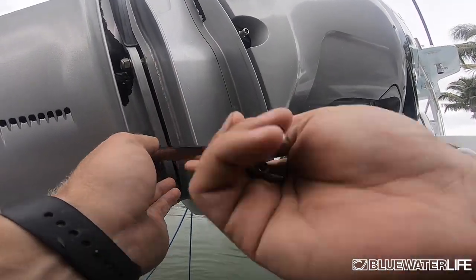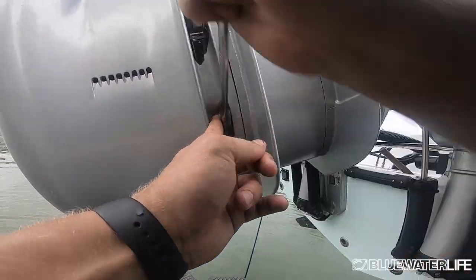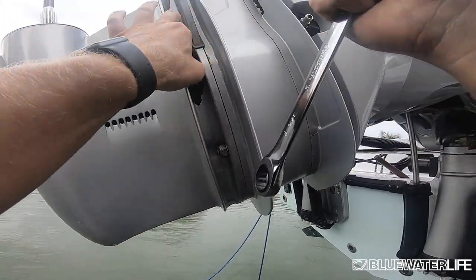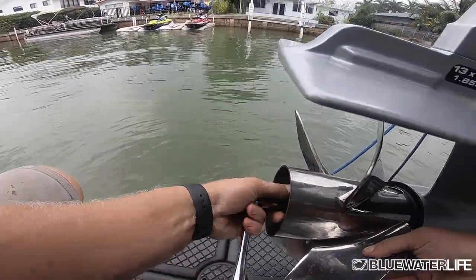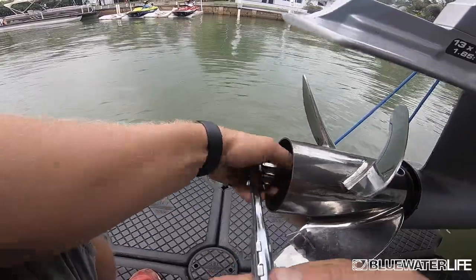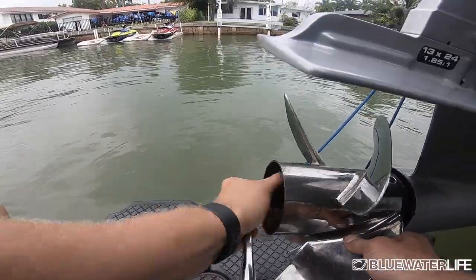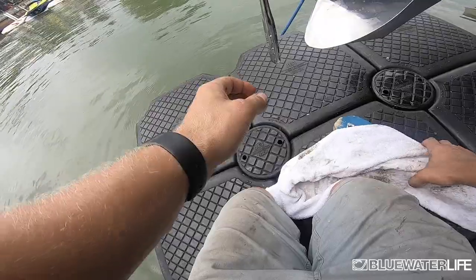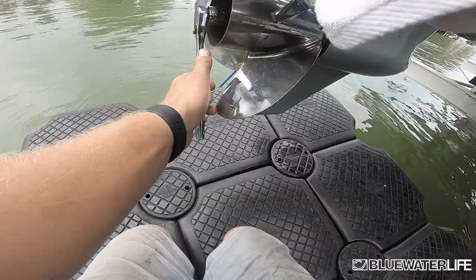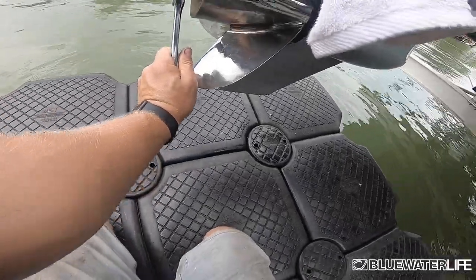Once I got that bolt on, I went around and put all five bolts on. Make sure you put some grease on there to help prevent seizing when you go to take them off in the future. Once hand tightened, take a wrench and tighten them up as much as you can — just don't over-tighten, you don't want to snap the bolts. Reinstalling the prop is pretty easy — put the prop on, hand tighten the bolts keeping all nuts and washers in order, then tighten it down. Use that piece of wood wrapped in a towel to prevent scratching, which helps get the extra tightness so the prop doesn't spin when you tighten with the socket.